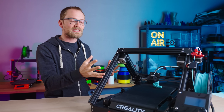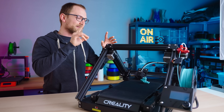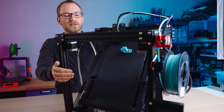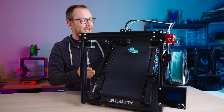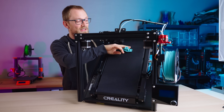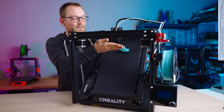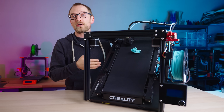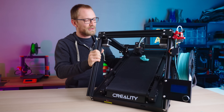So let me start out with what this actually is. It has a belt that feeds the print out away from the toolhead. To understand how the kinematics work, the easiest way is to imagine this as a regular CoreXY printer, because the platform up top is a CoreXY platform. Then you have the bed that is angled at 45 degrees and actually slides out under your printhead. Every print that you print — like this Benchy — is angled out at 45 degrees. The side facing towards the nozzle prints perfectly, but as soon as you go further than 90 degrees to the belt, you're already at a 45-degree overhang. That limits what you can print.